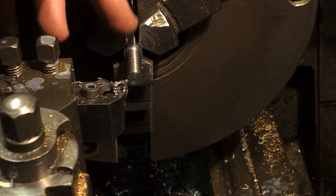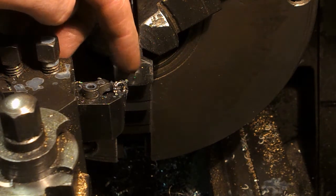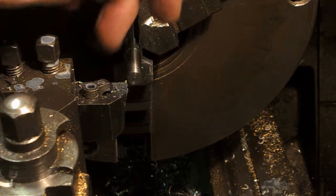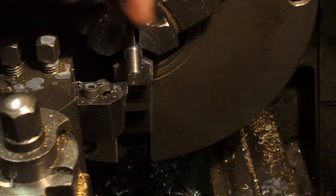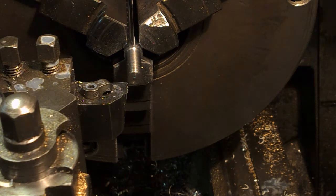Well that's got the case skin off. It's not a great finish. So I think what I'll do is I'll do the other one, get through the skin, and then I will change the tip back to a normal tip to turn it down to size before we thread it.